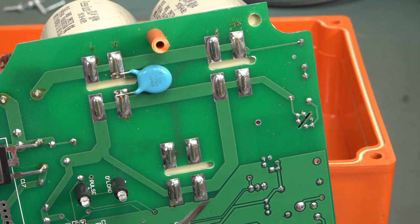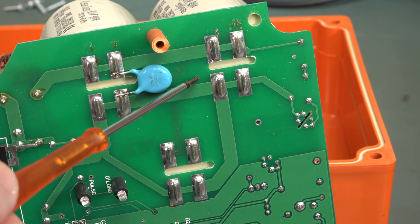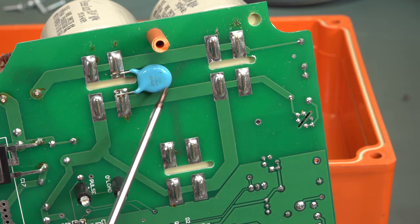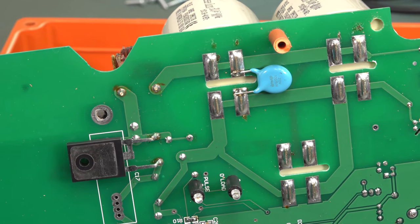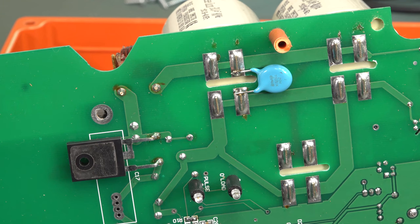We've got some LEDs. And no surprises seeing big cutouts between the capacitors here, although they don't extend all the way out — I would have extended those a bit further. They've extended it out one side but not the other. Is this an afterthought? There's a MOV on there, straight across that cap. Maybe they came a cropper in the design and added that as an afterthought, because otherwise you'd put that directly on the PCB. And there's another switching transformer on its back on the bottom side, which is unusual — don't know why you wouldn't have laid that out on the top side. It's all a layout issue.